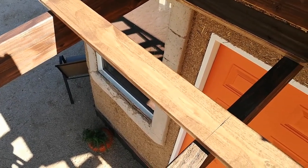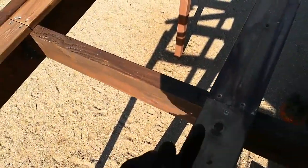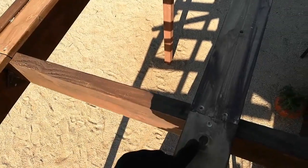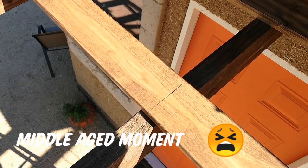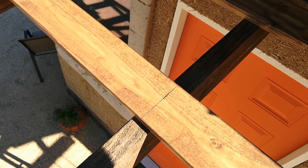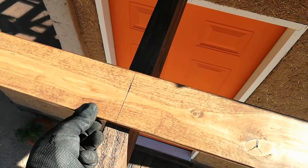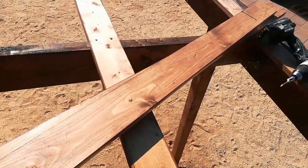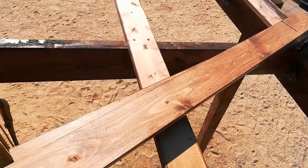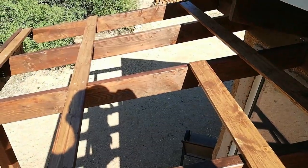I'm going to apologize ahead of time for the wind — it's picking up a little bit, but I wanted to get these purlins installed today. I've got the first two rows installed, and as you can see, I forgot to stagger these joints. I meant to the whole time, but I had a lapse of memory. So what I'm doing now is taking an 8-footer, marking dead center, doing this 24 on center, and I took another 8-foot purlin and split it in two. Those will go on the end so I have my joints staggered — it should add a little bit more structural integrity.